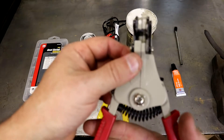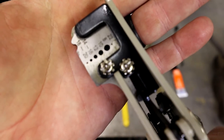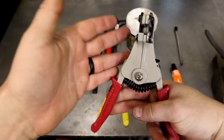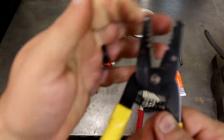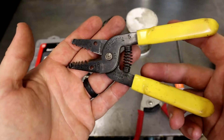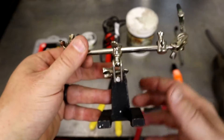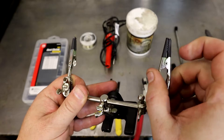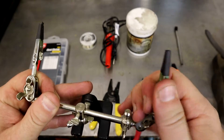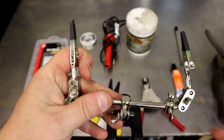Here are your fancy wire strippers — these grab the wire and strip the insulation off in one move with different size slots for different gauge wires. They work pretty quick and it's hard to go wrong. The old standbys are also great — they've got a cutting part to clip and different size slots to strip wires. This here is what they call a helping hand — basically alligator clips. I put heat shrink on the clips because the alligator teeth can pinch through the wire insulation. It's adjustable so you can put one wire here and one there and have your hands free for the soldering iron.